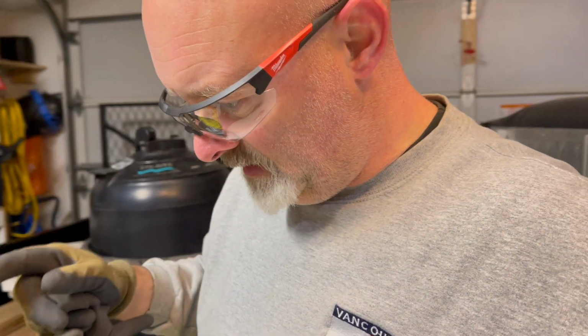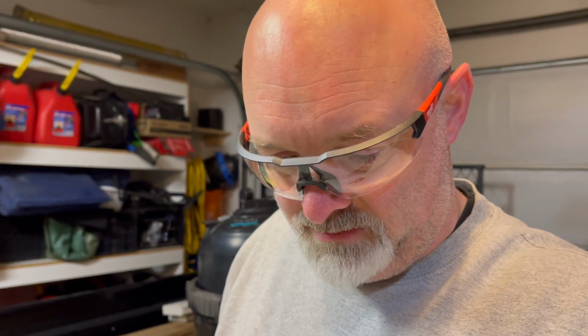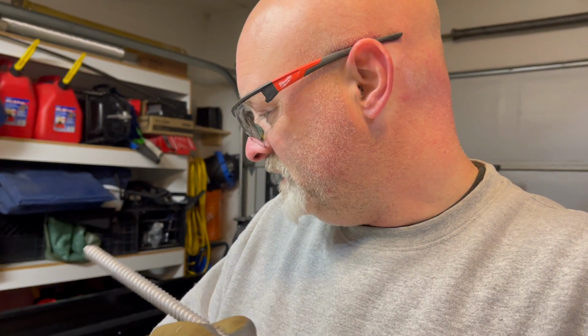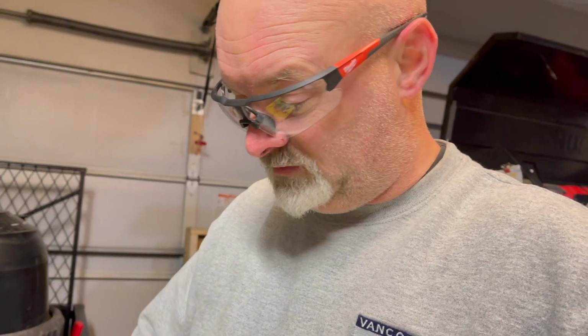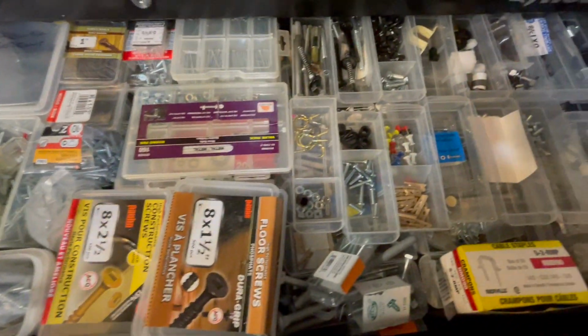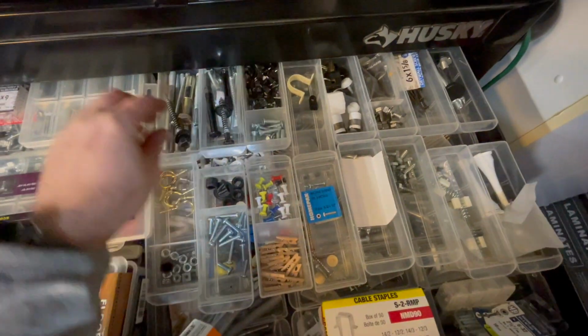My next thing is I want to secure that plate, and what I'm going to do is use a lag bolt to go straight through into the main deck structure. Now, I picked up this one. I think this one might be too big for the simple reason I don't have a drill bit long enough to put a pilot hole for this. So this is a 10-inch lag bolt. I think I overdid it. But these will be used to come through the other side into the stair stringers so that we can batten it all together. And usually I keep spare bolts from other projects.